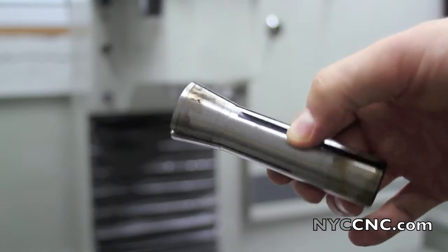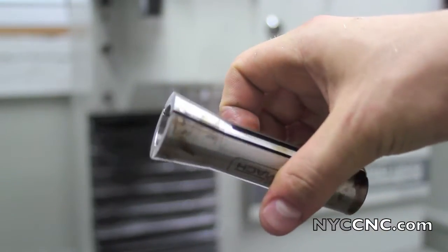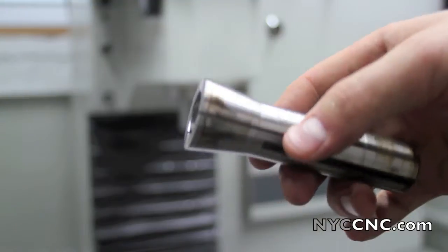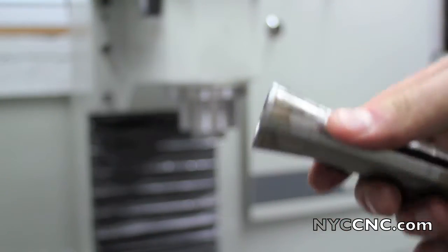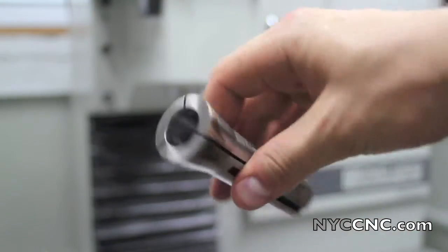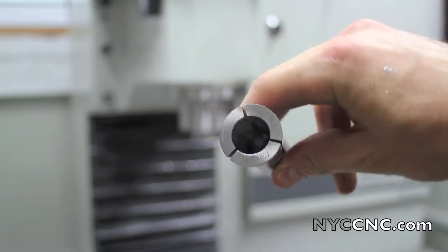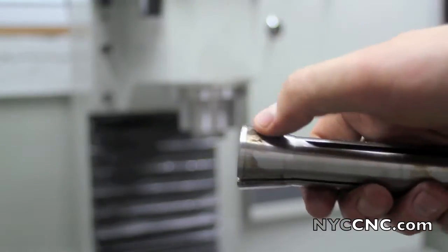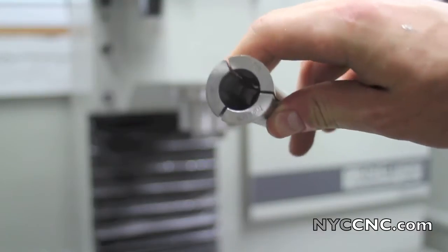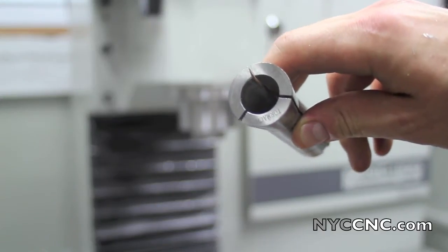While I'm at it, might as well share what my R8 TTS collet looks like. I just took this out of the mill — it has not been out since I installed the power drawbar, probably in November of last year, so that's about 10 months, and I've probably done a few thousand or more tool changes on it. It needs to be clean. If you read the TTS white paper it talks a lot about holding power being tied to cleanliness, and it's got some grime on it. It is a wear item, meaning eventually you buy a new one.